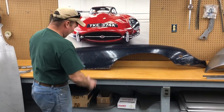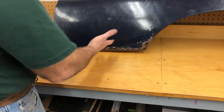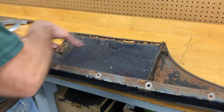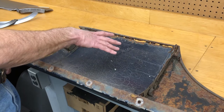For example, you might have a wing that looks like this. This is very, very common on the E-Type. What happens is you've got your wheel in here, it's throwing stuff up, you get moisture. And especially on the left hand — battery acid and everything. Water comes down in here, gets caught in this rolled edge. And then you have this problem.